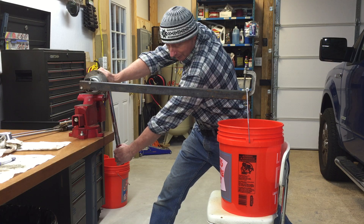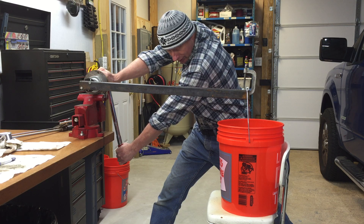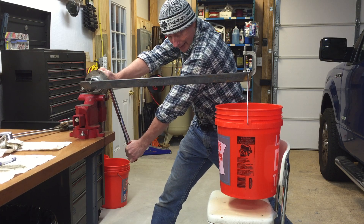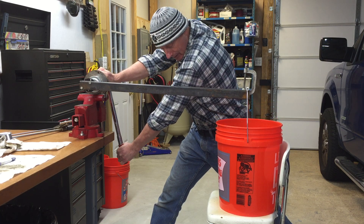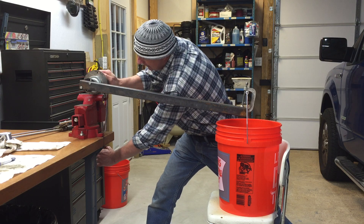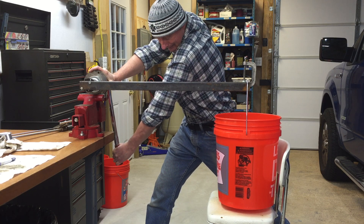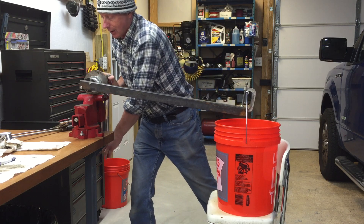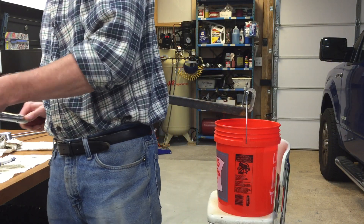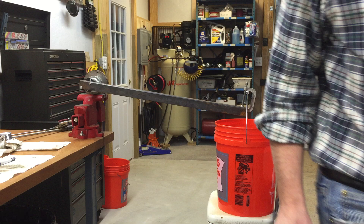It takes a whole lot of effort, especially for a guy who only weighs a buck sixty. Listen for the click and you'll see the bucket just level off — there's the click, so 100 foot-pounds. I'd call that calibrated. We'll take one more try — we're really at 90 degrees — yep, click off. I'm calling it calibrated at 100 foot-pounds, because that's where I use it when I set lug nuts on cars, which like to be set at around 100 foot-pounds. Thanks, that's all folks.